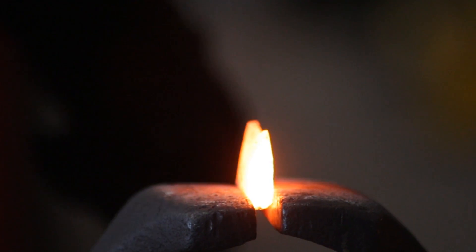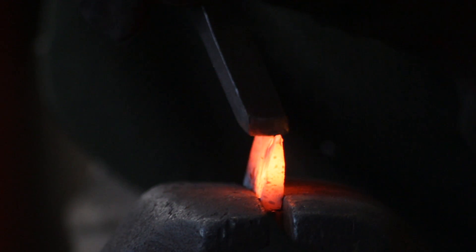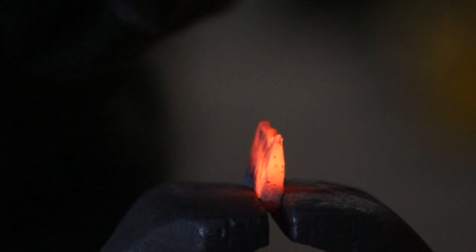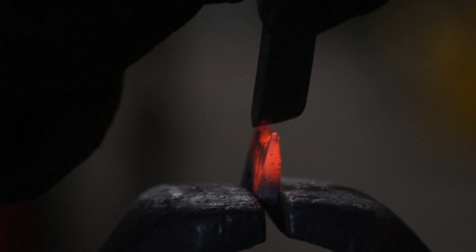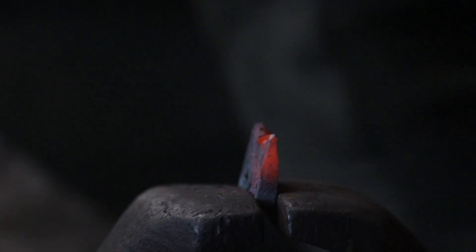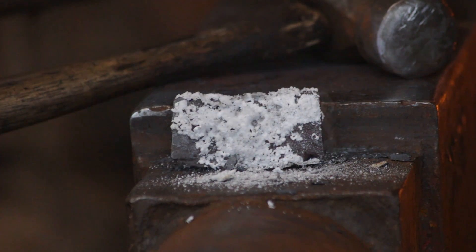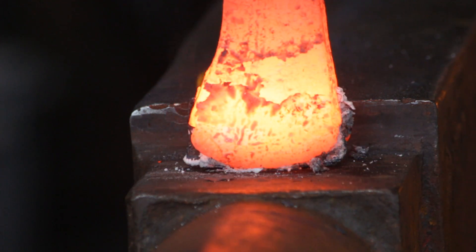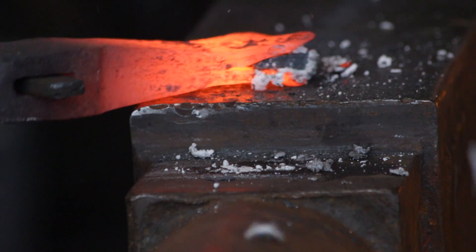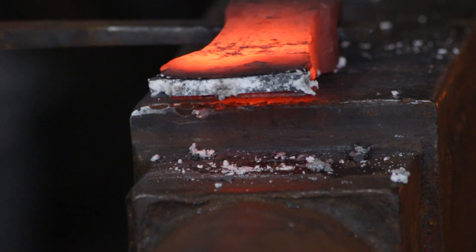You can also put that curve in after you've welded everything together — it doesn't really matter. I will head back to the vise and just cut some little teeth in the bit, coming in at a 45 degree angle and pushing those teeth out from two different directions so that I have teeth coming out both sides — that'll just help it grip into the jaws of the axe. Flux it before welding; this is carbon steel so I always flux carbon steel — it saves on decarburization. Then I will drop the axe down and tap the insert into place and close it up. You can see that the wrought iron jaws are coming lower in some places than the high carbon steel bit — that will actually protect the high carbon steel from oxidization during the welding process.